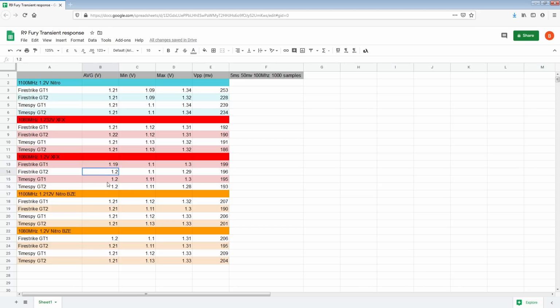This is another thing that honestly I could have dealt with better with the voltage readings, because the average voltage, I think, is getting pulled up by the overshoot more so than being an actual reading. Well, I should have also hooked up DiSense or something. And another issue is that the accuracy of the average voltage is again plus 4 millivolts, minus 5 millivolts. So there's some rounding error in there as well. That's actually kind of significant.